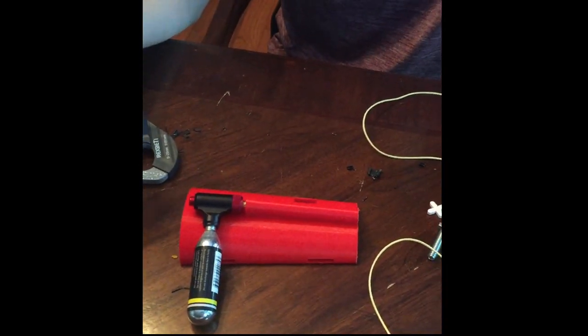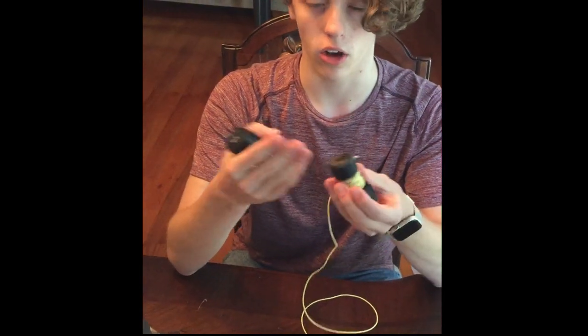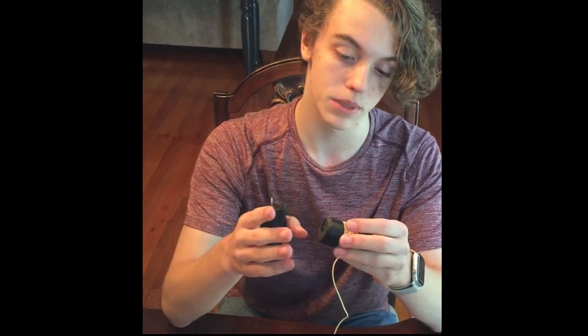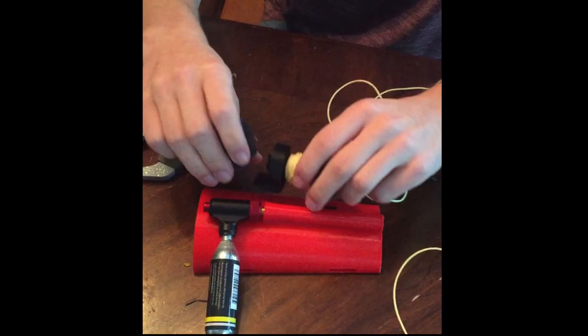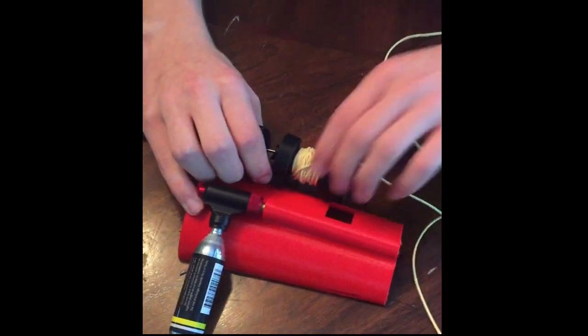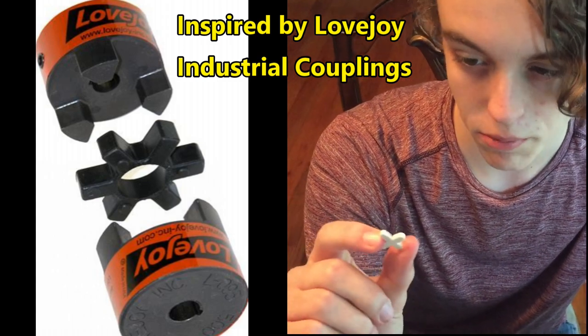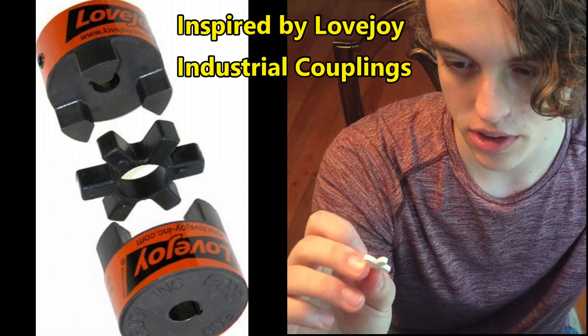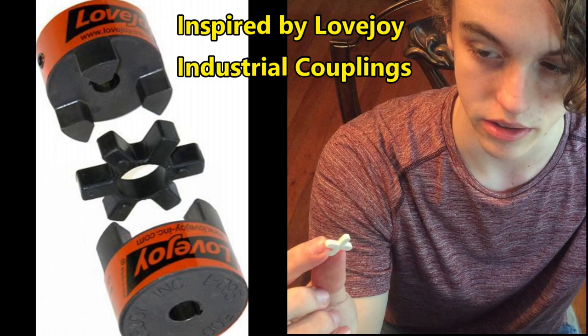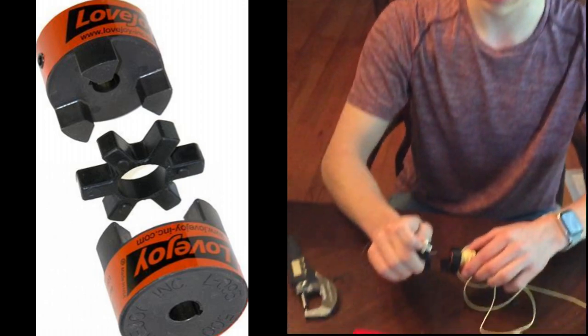In the final days of the project, we've made a lot of adjustments that should have been done a long time ago, but we got around to them just now. We still need to attach the motor mount, the spool needs attaching, and the cap we put over it — like in all fishing rods — needs to be elongated a little bit for the string to pull off better. The string also needs an eyelet right here to guide the trajectory. The only way we can make it spin is by making a coupling between the motor and the spool, using this rubber buffer part. They use it in industrial couplings — it reduces strain on the turning motion and prevents the pieces from fracturing. It's a pretty important part and needs to fit quite precisely for the retraction to actually work.